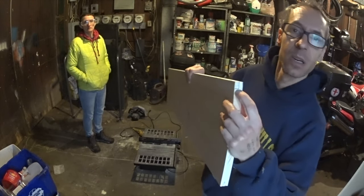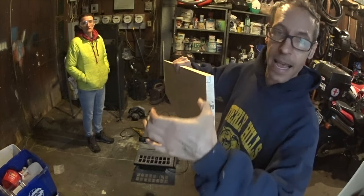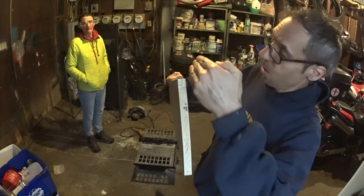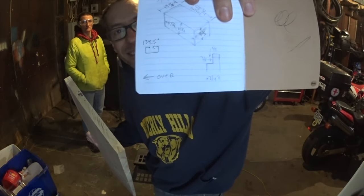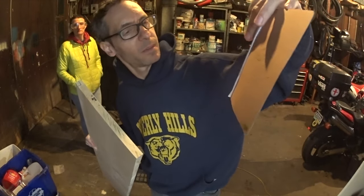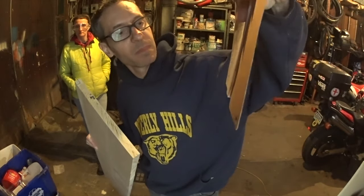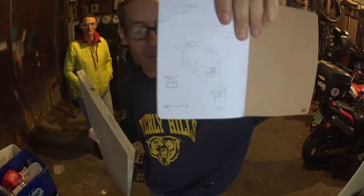Here's a shoulder — this is where the tops of the frames hang on. I've got to cut off this rectangular section all the way down the board. The blade's got to be 3 and 5/8 high, and then the fence is set at 3/8. So that's the first cut, and you'll see how I do it.